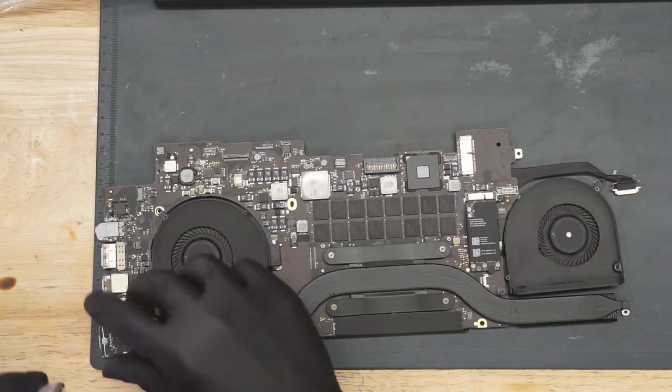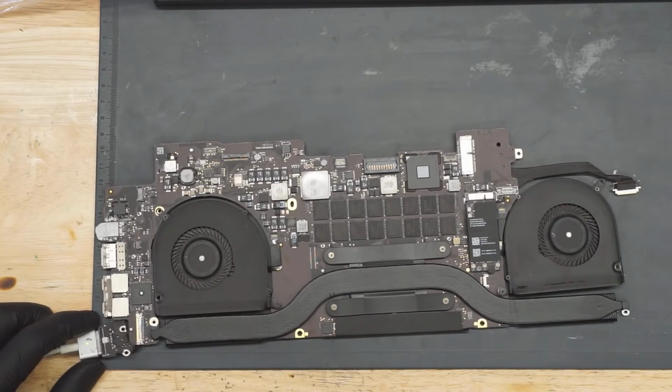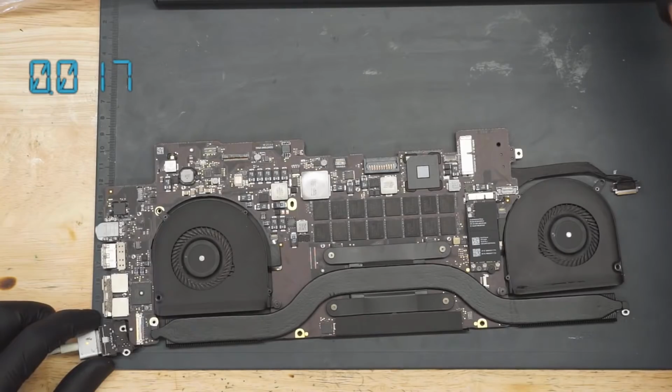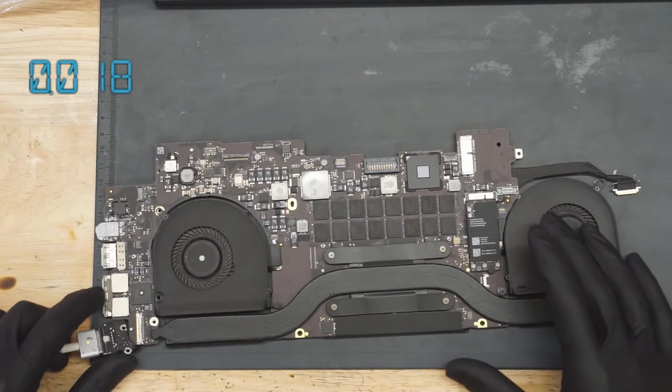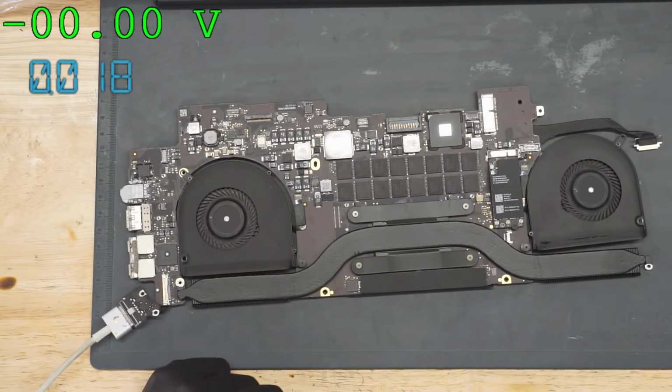So first thing, let's see. Once everything is unplugged from the case, does it turn on? And there's no fan spin, and we're still taking 17 milliamps. 18 milliamps. So I'm going to get the multimeter software going on the screen. We're going to open Paul Daniels' Flex Board View software that I have not updated for about 3 years now. I'm going to look up what version of this software I'm using. This software is some old stuff.